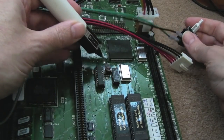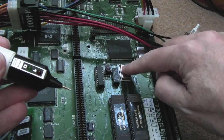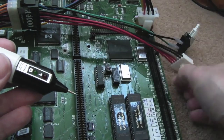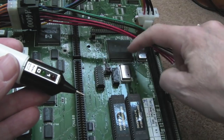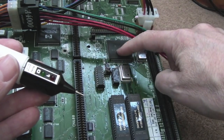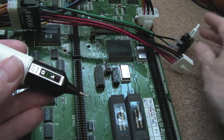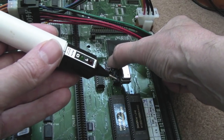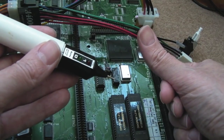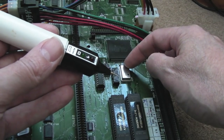On this chip here, the 7474, the clock goes through here, even this 50 megahertz clock, I think, is divided down by the 7474. But at the same time, this 7474 is responsible for one of the signals that comes to Gary, that ultimately then gives us the output enable, I think, down here. So I was surmising that maybe this chip is faulty, because it looks like we've got a clock thing going on here. We had some weird behavior related to the 50 megahertz clock signal.